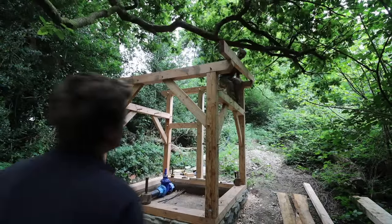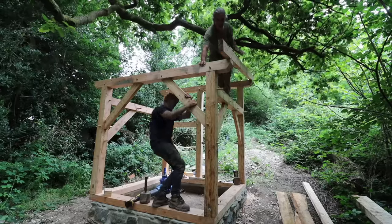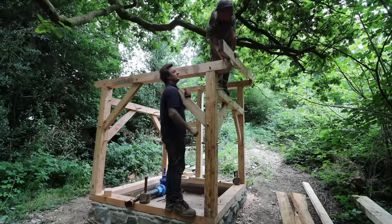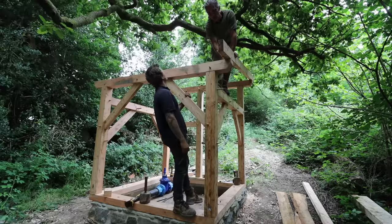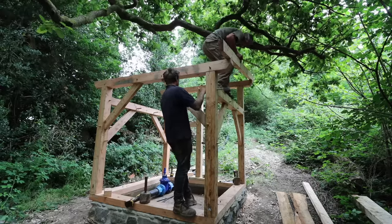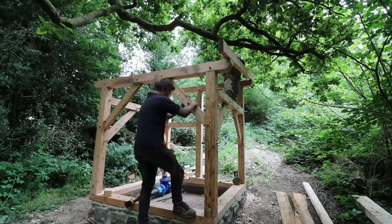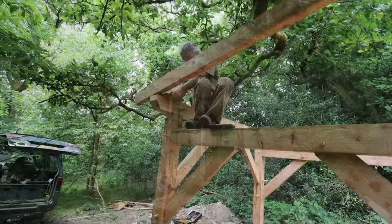Start getting some roof timbers up. Right. So what do you reckon all round wise then? Oh, what have we got there? Because we're going to cut that flush, aren't we? What's that big bird then? Something buzzing past me again. Can't see it. Right, that's a foot roughly. Got to remember the same. I think it worked out at about 250mm overhang each end. Right, so I'm at 250 here, but yeah, that's about to be cut off. So yeah.